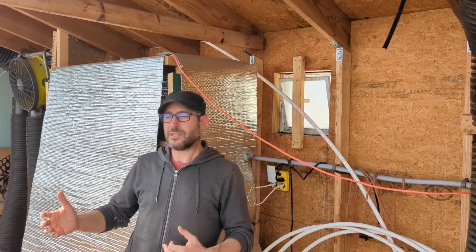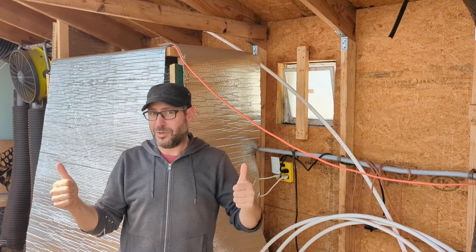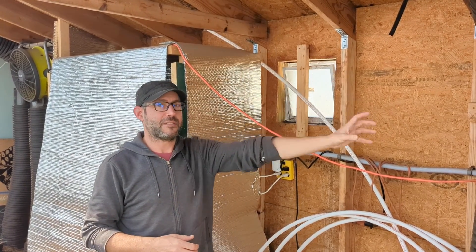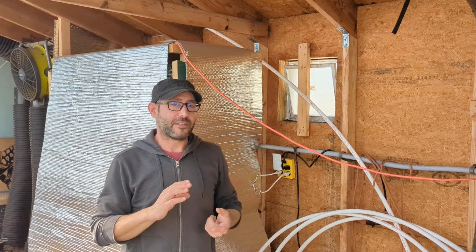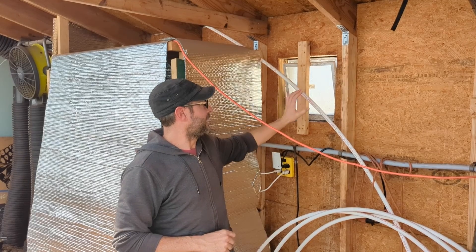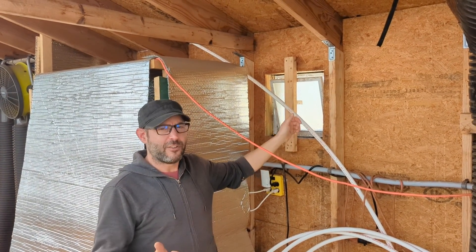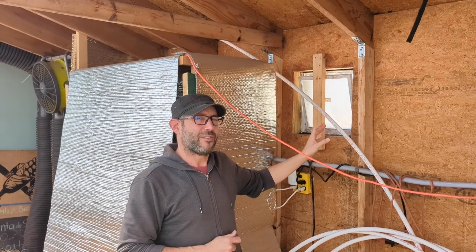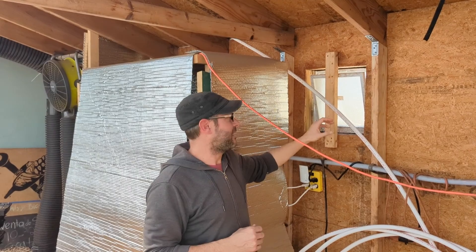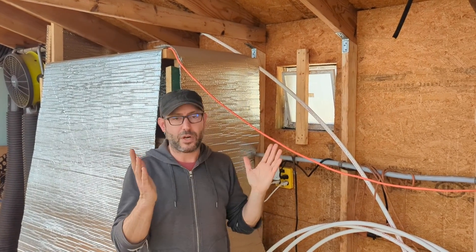The design of this greenhouse has a massive glazing wall, which means we're getting a ton of solar energy when the sun is shining — which we want when it's cold outside. But because there's so much glazing it can get more heat than we want; we're not able to capture it all into the ductwork and charge up the soil, so we've got excess on top of that. The designs rely solely on passive ventilation, and in the plans these were spec'd as basically a basement hopper window. Those turned out to be really poor quality — the vinyl does not maintain its integrity, it bends a lot, it does not seal well, and the glass breaks very easily.